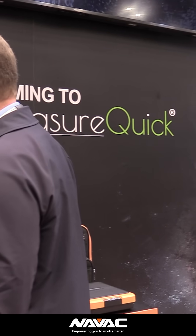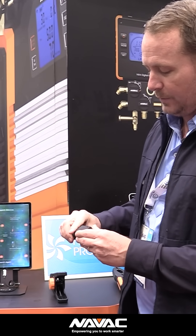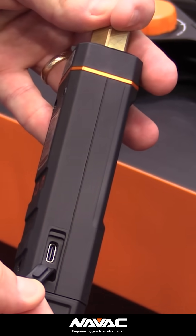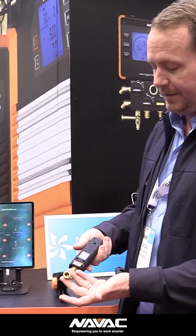This is something I'm super excited about — the probes family. The one thing I love about all of these probes is that they have an onboard display. Really easy to use. It has a high-low switcher so you can switch between the low side and the high side really easily. Onboard charging port with just a standard USB-C, which makes it really easy to keep charged compared to a lot of other products on the market. And it also has this 45-degree angle, which to me is huge for pressure probes — makes it easy to get on.